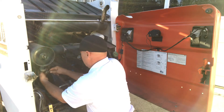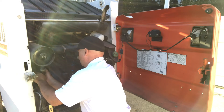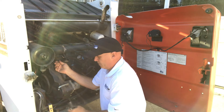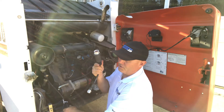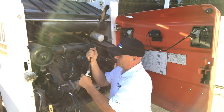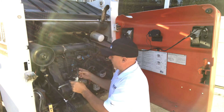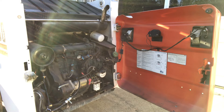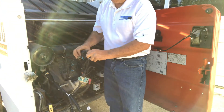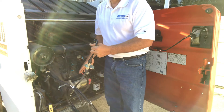We take this little cover off here — it snaps right here. We've got the cover off. We take the mating adapter and plug it in. What I have here is one of our Genius controllers — this is the fastest way for me to test this. It plugs into the 7-pin and only requires that you have the key on. You don't even have to start the machine because it reads the codes off the machine. I have a little indicator on the back so I can tell whether it's working. You can see it flashing — that tells me the controller is talking to the bus of the machine and we're ready to go. All of this is operational.